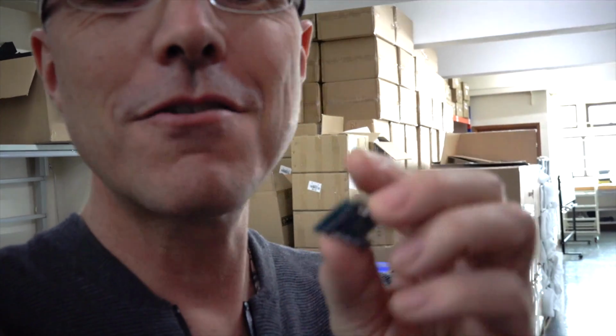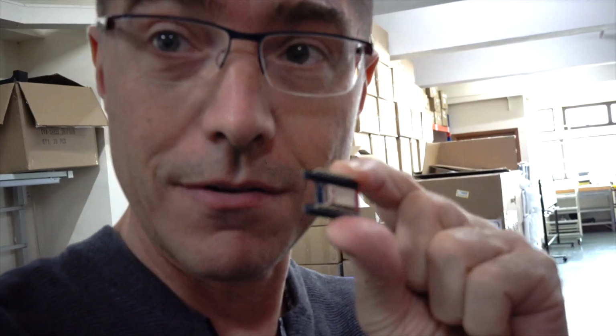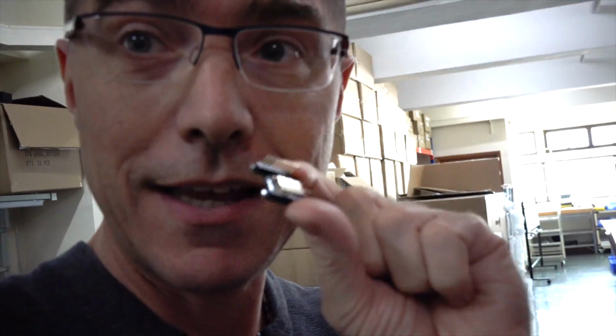So who knows, maybe some other companies using the Red Bear Labs Bluetooth module will want to buy ours. We also extended the board slightly with some extra pins, and that actually allows you to put a debug port directly in. Those are pins for a serial port. So that opens up serial port control directly to the espresso machine and who knows what. We've also experimentally made a version of this that has Ethernet and Wi-Fi on it. So the idea is we do know that our communications board is pretty future-proof.